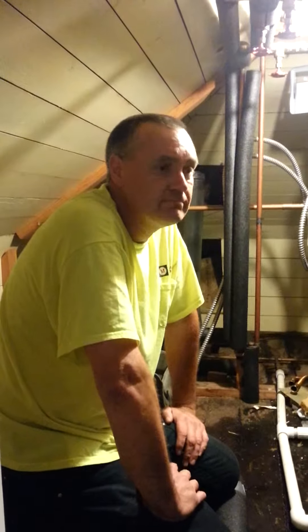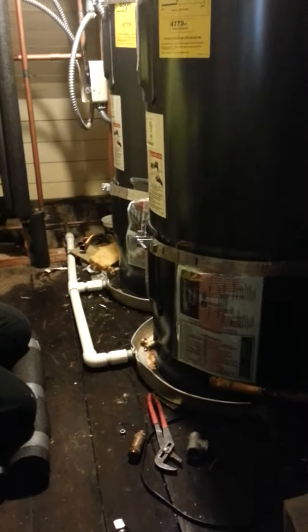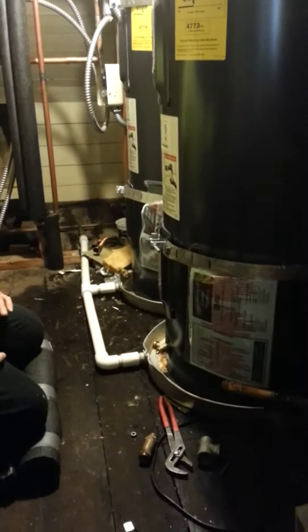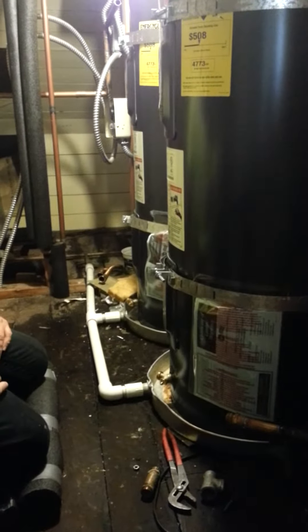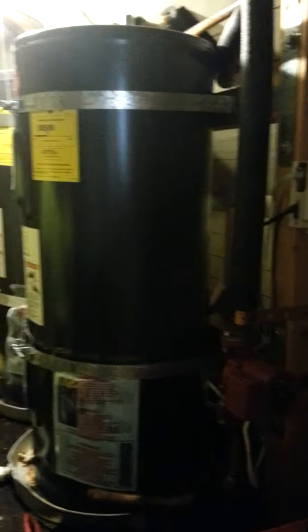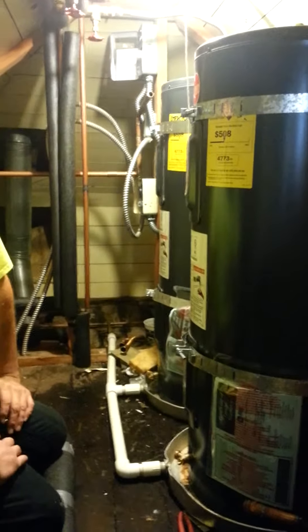You can't get all the water out. So these water heaters, as you can see, are above the kitchen. They're both in pans, which captures the leaking water for the most part, but these probably overflowed. So we've got them in pans to capture any leaking water in the future to protect the kitchen down below. As you can see, they're very well seismically strapped. We're going to get an inspection on these two water heaters shortly, so they'll be correctly permitted as well.